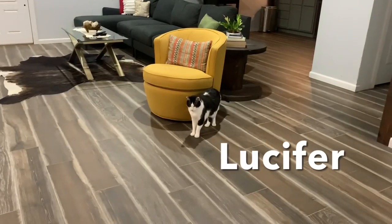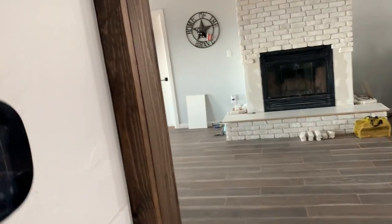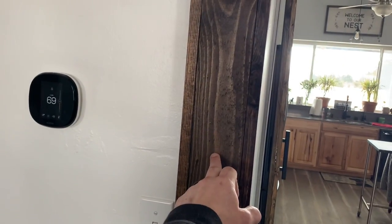So this is what we're dealing with — this big, massive, long beam. It's about a little bit over a foot on one side and the ceiling drops down, so it's like 14 inches to 2 inches. I want to wrap this all the way around. You can tell I already started on the sides, and I have the face pointing toward us sticking out further, which makes it look more seamless. I put that board on first and then put the outside ones surrounding it.